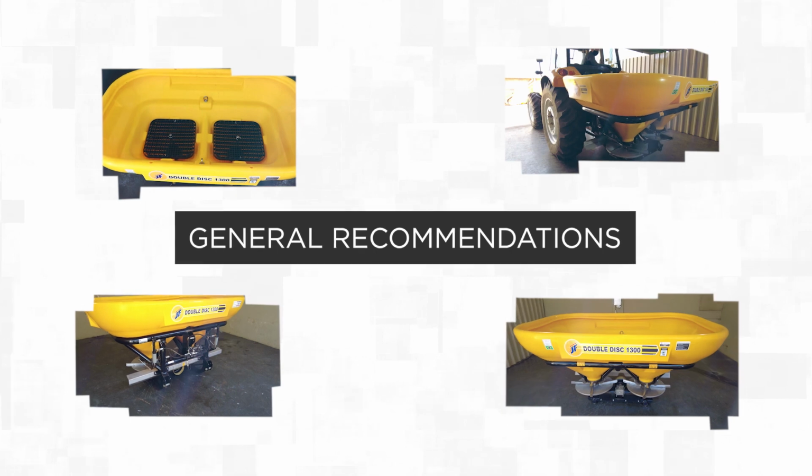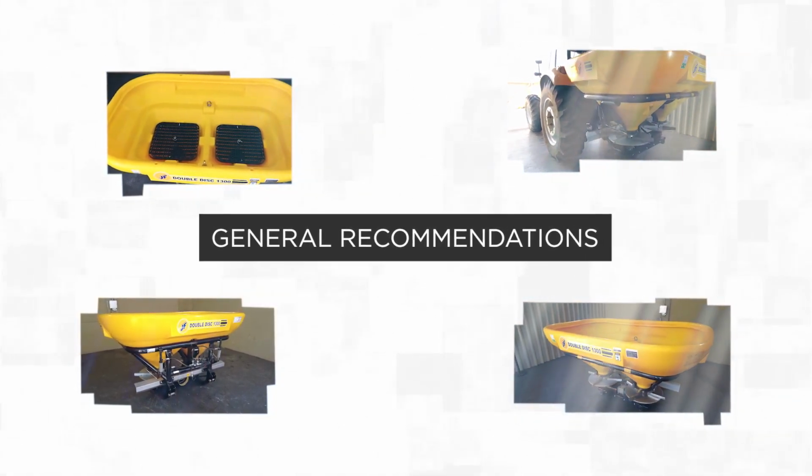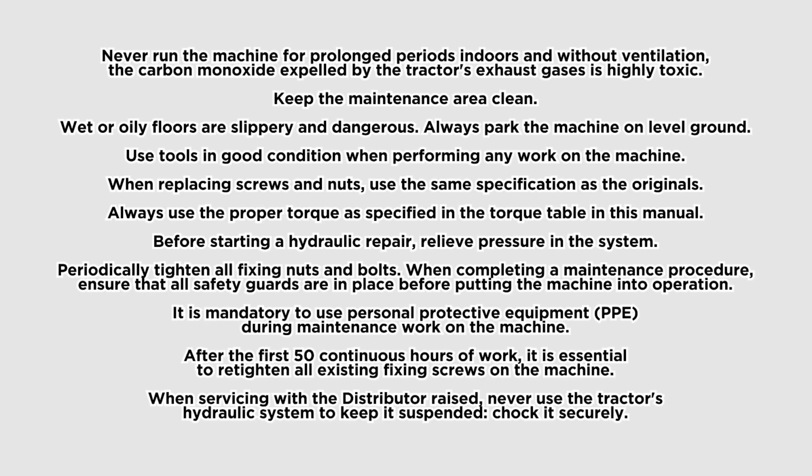General recommendations. Never run the machine for prolonged periods indoors and without ventilation. The carbon monoxide expelled by the tractor's exhaust gases is highly toxic. Keep the maintenance area clean. Wet or oily floors are slippery and dangerous. Always park the machine on level ground.